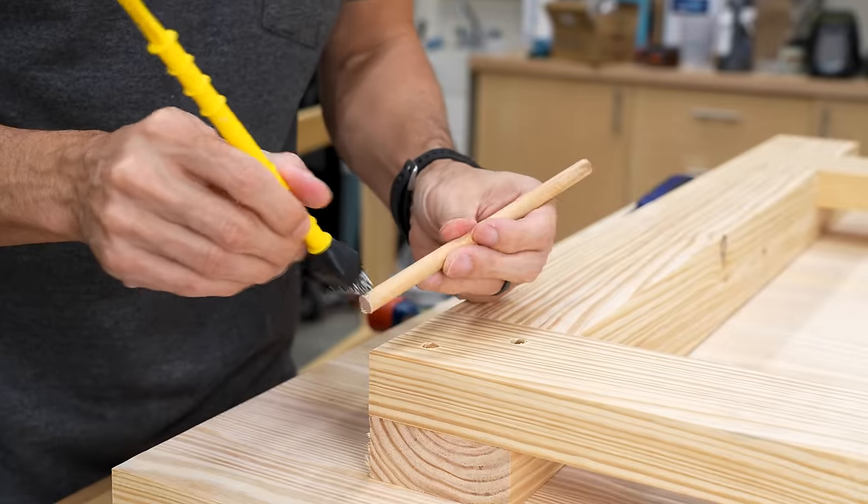I got three rows of holes all the way along the front edge of the bench, and that drill bit is a beast — amazing, highly recommended. My old bench had holes three inches on center, so the four-inch spacing on these is going to help out. I'm only going to run another row of three holes on each end and leave a large area on the bench that doesn't have any holes at all. If I want to add more holes later, I can just grab the template. I put a little chamfer around each of the bench dog holes to help keep the edges from blowing out. Now I just need to get this ready for finish.